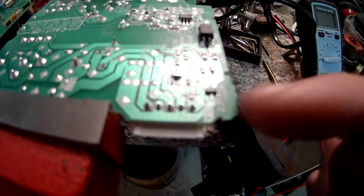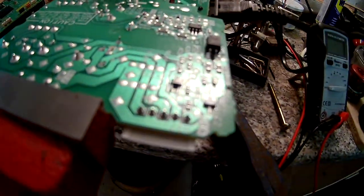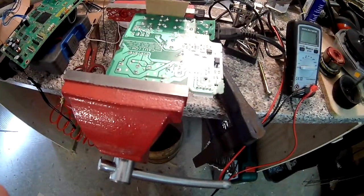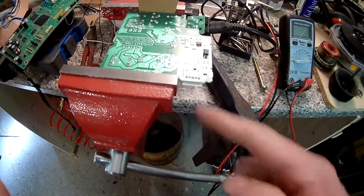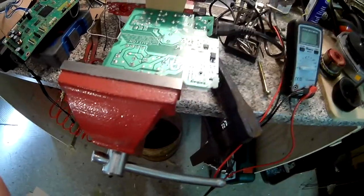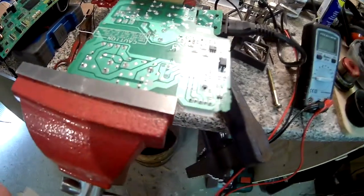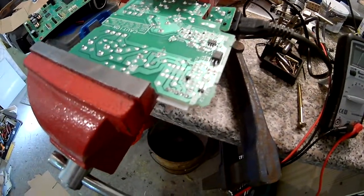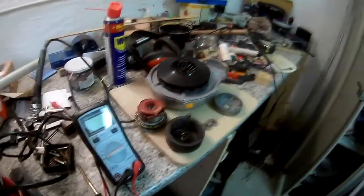I'm wondering if those two transistors make it an analog circuit where I could just put a pot on the enable pin to change the voltage — but I doubt it. I was going to try putting a potentiometer between one of the power pins, but as soon as there's power it would push the pin up and blow things up. So I'm sticking with a 3.3V regulator to hold the enable pin, and then I'll fiddle with the optocoupler feedback using a high-value pot to adjust the output voltage up to the 39–40 volts I need for the blower.